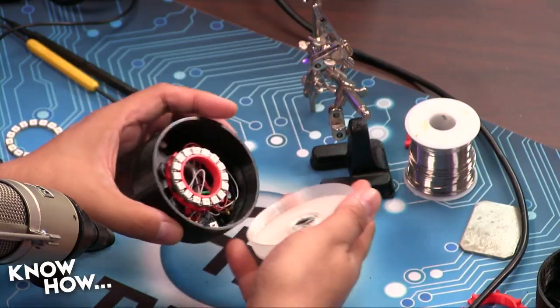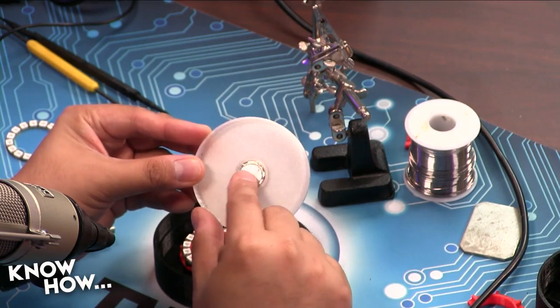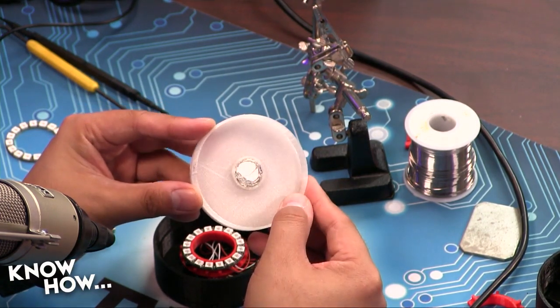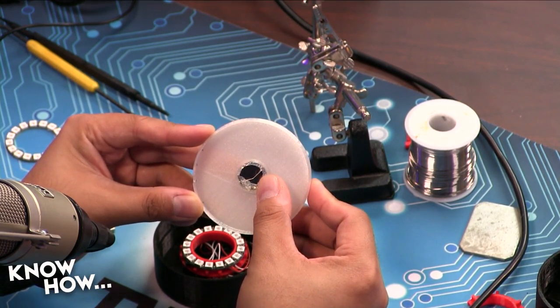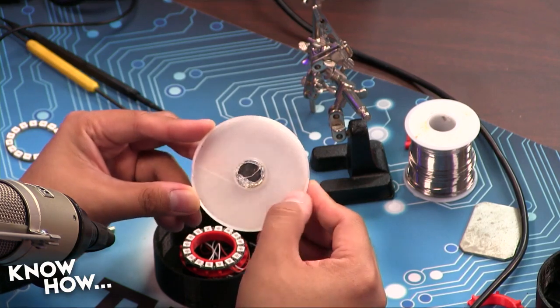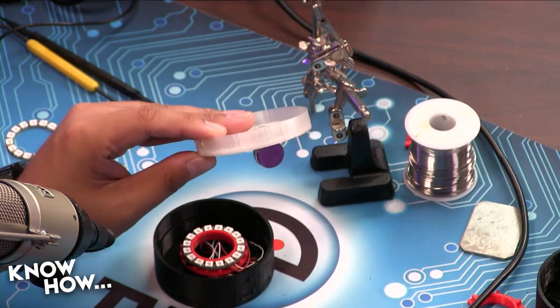Now, I want to start you on the project so that you have as much time to complete it as possible. I'm going to go ahead and disconnect our little prototype here. Let me show you what's actually inside here. Now, the prototype model is not as good as the finished versions because it's a prototype, and a lot of this was just slapped together. But inside here, all of this is a diffuser. So this is clear PLA material with the magnet in the middle. Now, it's hot glued. My original design was to make it super tight just by pushing it in there. But then I realized if we did that, there'd be no way to remove it unless you destroy the piece. So it's just hot glued. You can strip off the hot glue, remove the magnet, but that gives us this nice little ferrous surface.